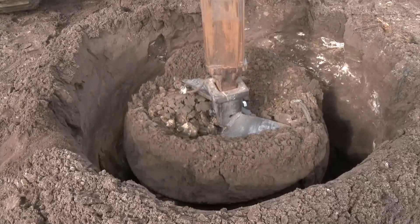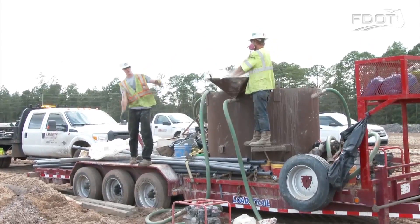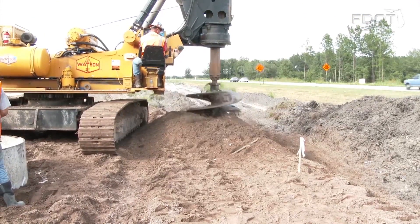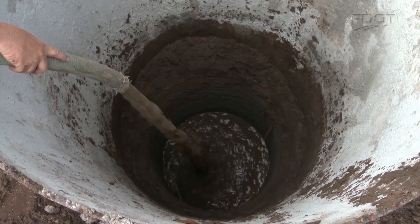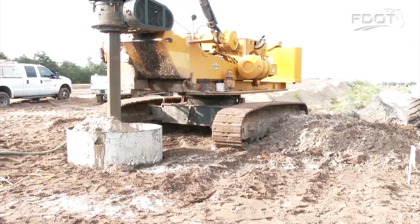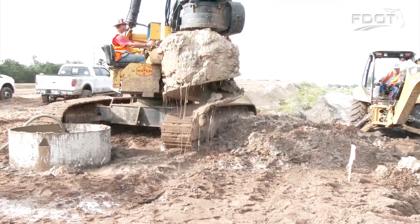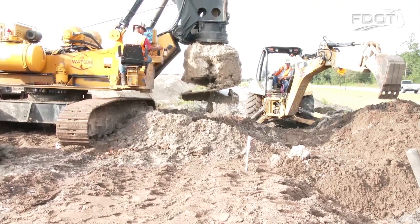One commonly referred to as a drilled shaft. The size of columns varies based on soil conditions and the structure they're supporting. In our coastal environment they are constructed strong enough to resist storms and hurricanes. These columns or drilled shafts are most commonly used when FDOT is constructing overhead signs, high mast lighting, and mast arm traffic signals. They are also used to support bridges when deep or special foundations are needed.